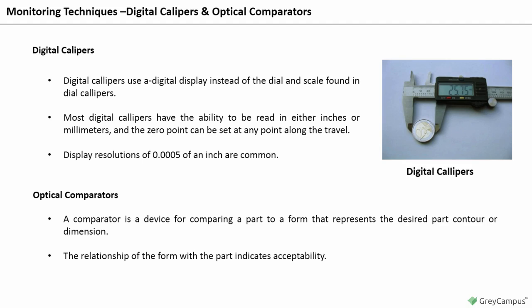A beam of light is directed upon the part to be inspected, and the resulting shadow is magnified by a lens system and projected upon a viewing screen by a mirror. The enlarged shadow image can then be inspected and measured easily and quickly by comparing it with a master chart or outline on the viewing screen. To pass inspection, the shadow outline of the object must fall within the predetermined tolerance limits.